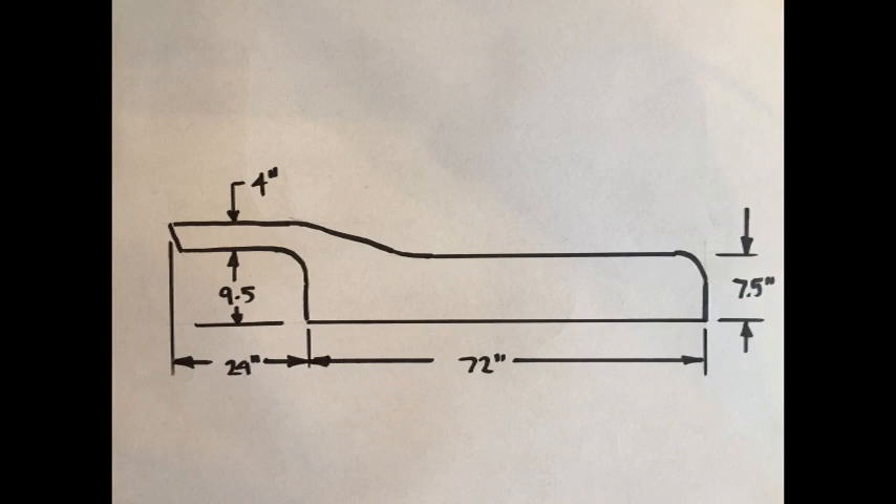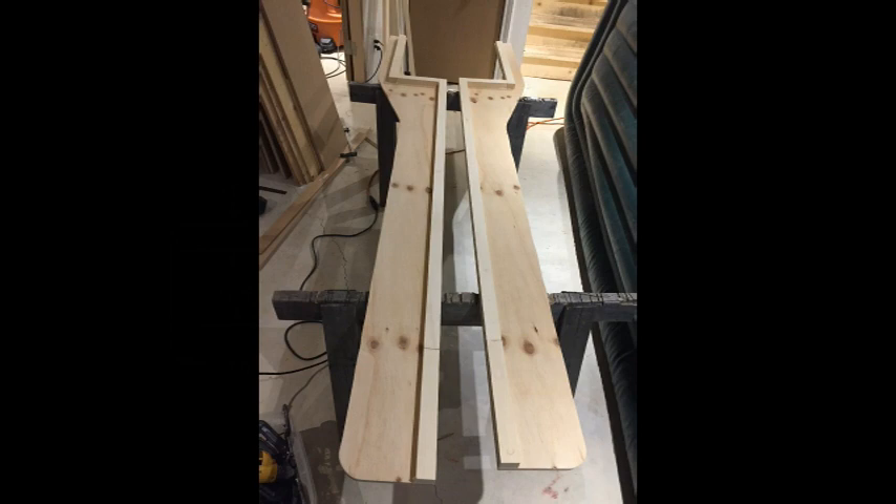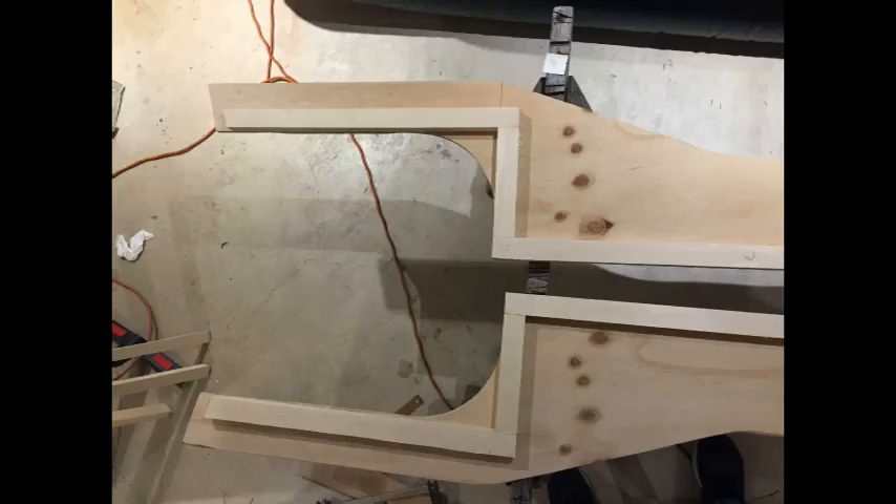This is a view of the side panel that gets attached to either side of the floor. You'll need a right and a left side. If you get this right, the rest of the boat goes together very, very easily. Here's a view showing me gluing in my supports for the side panel to support the other pieces of plywood and to attach the side panels to the floor.